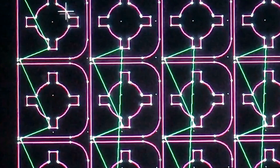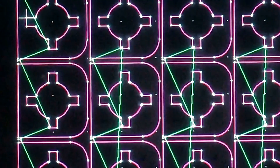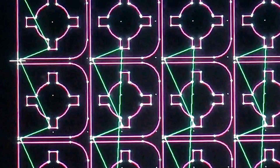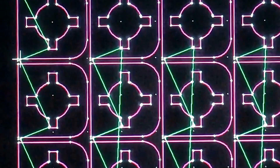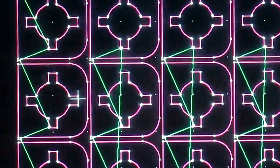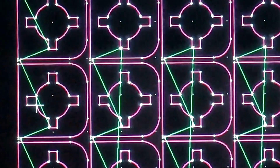As the parts are being cut, the computer system shows a detailed map tracing the cutting path so the operator can follow the process. The purple lines indicate cut lines. The green lines are called traverses. Traverses are where the head moves without cutting, so it can jump — typically from a cutout to an outer contour, or between one cutout and another, or between holes. You'll also notice that the movement slows as it comes to the corners. The computer automatically figures out the best way to move the jet to make a perfect part.